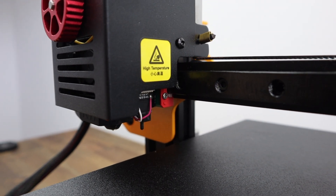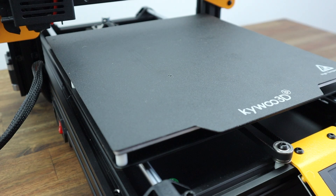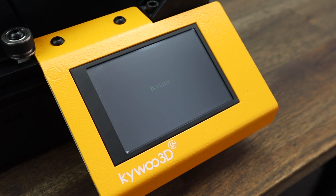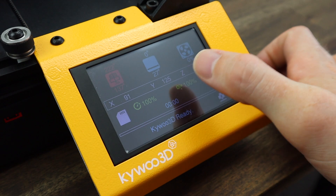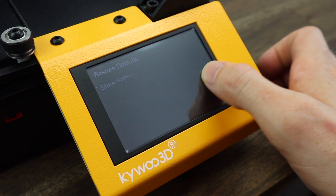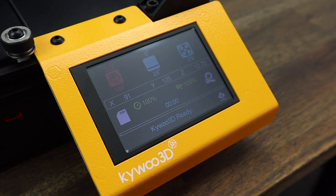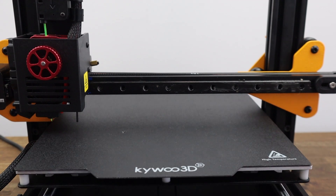Some other things they've changed include an improved bed leveling sensor and a glass print bed. The glass print bed is great once you've dialed in your bed leveling — I use these on my other 3D printers — but I actually quite like the simplicity and ease of use of the magnetic print beds. My only real complaint with this printer is that the user interface on the touch display is not as intuitive as I would like. There are a couple of missing features — things like preheat that automatically sets a bed and nozzle temperature, or just generally being able to find options since there isn't really a main menu; each item's settings are within each icon on the display. This is obviously not a deal breaker, but it does take some more time to get things done.